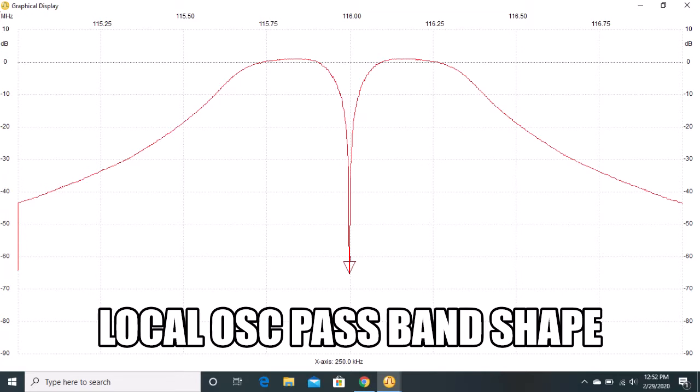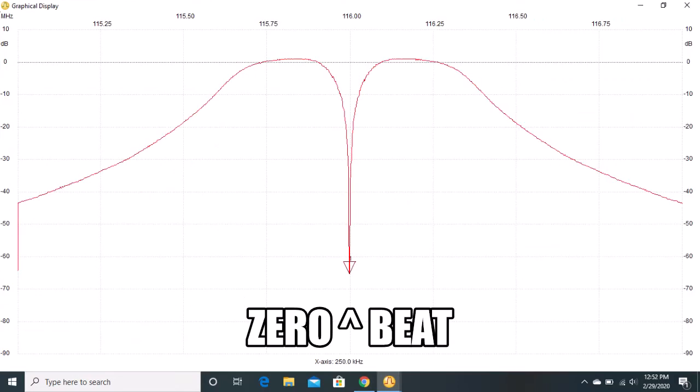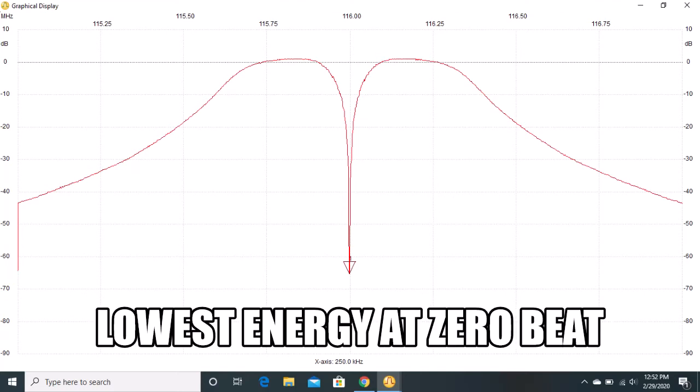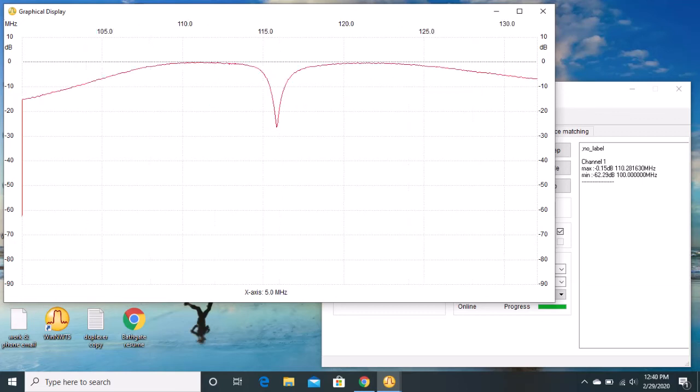I'm thinking — why wouldn't they just put them on the same frequency? Well, they wouldn't get any energy. If the tracking generator and the spectrum analyzer local oscillator were both on the exact same frequency, the tracking generator energy would be in the notch at zero beat, which would basically have no energy reaching the detector. So it needs to be shifted away from the local oscillator frequency to have enough energy for detection. I don't know the exact frequency offset, and I found no way to measure the tracking generator offset or compensate for it in the software so it reads correctly — so you've got to do it visually at this point.